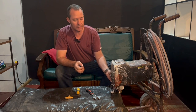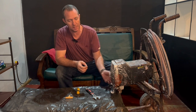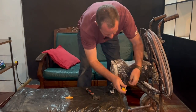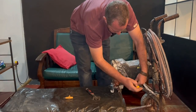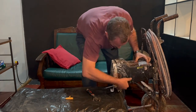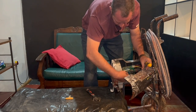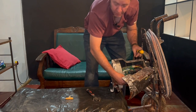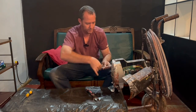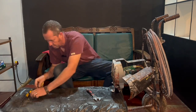Now, from the pressure regulator valve, there's a cable running to a PC board, and that is connected to the pump. So if we take off the front and this comes with it, it will yank on that, and we don't want that. So we're going to open the covers. Okay, so once we've opened this cover, we can unplug that pump wire, the pump controller valve wire, and now we can continue to the front. Open this cover.